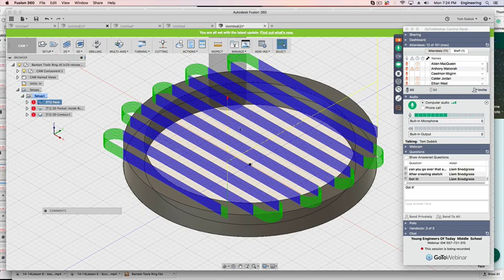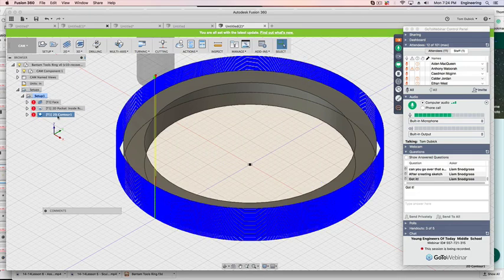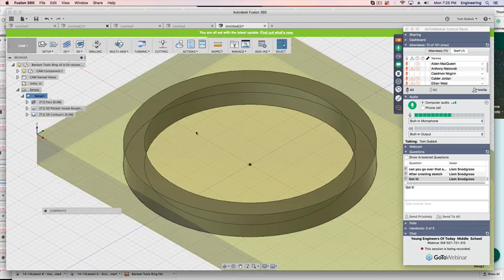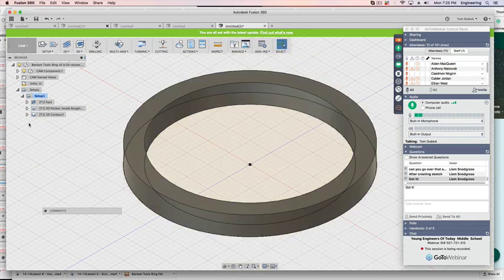So here's the different tool paths of what it's doing. It's saying, hey, this is the old tool path, but you just made changes. That doesn't mean it's necessarily the right tool path. So what we do is we right click on setup, and we say, all right, generate a new tool path. This will be based on the sketch and everything we just did. Notice this. No more red marks. If you can't change it, or if the toolpath stays red, you're still in Sketch on the other side. You got to make sure, go back to modeling and turn off sketch.